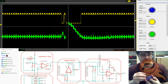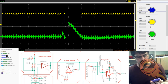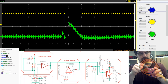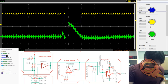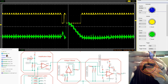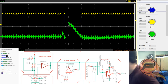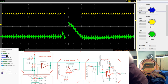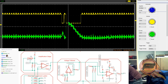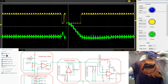Now I realized that introduces some instability into the extruder. However, I've developed it in such a way that it won't go further that way. So there's a limiting set of bolts at the top that screw all the way through and attach on there, so it can't move further that way. And there's going to be very strong springs. We have a 7.5 millimeter spring that you see being used on extruders. And just pop those in there. And it holds it very, very firmly right in there.